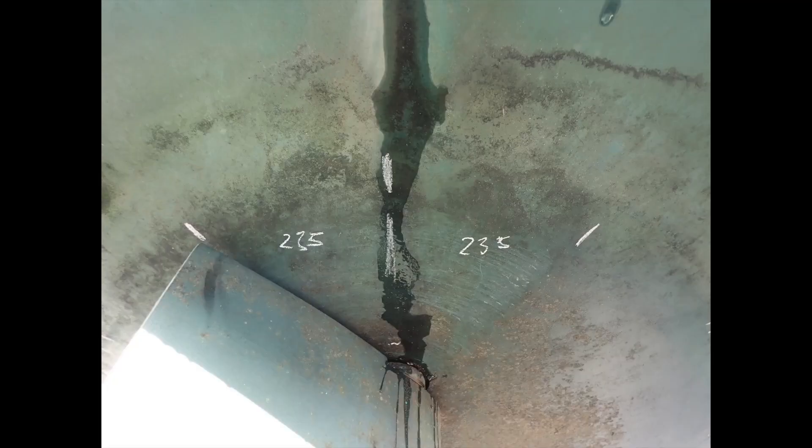To measure this is quite simple. Place a chalk line on the hull above the rudder when it's midships, then move the rudder to the extent of its range to port and starboard. Put another chalk line on the hull and then measure the distance from the centre line to these marks in millimetres. You can see a typical set of results in this picture.